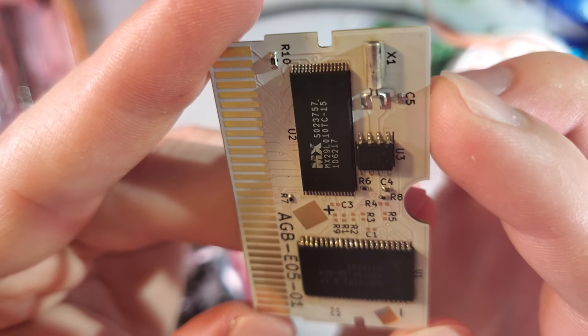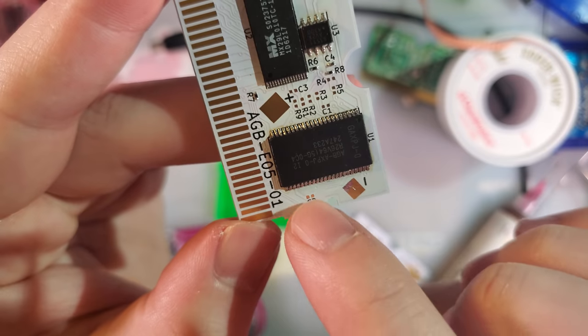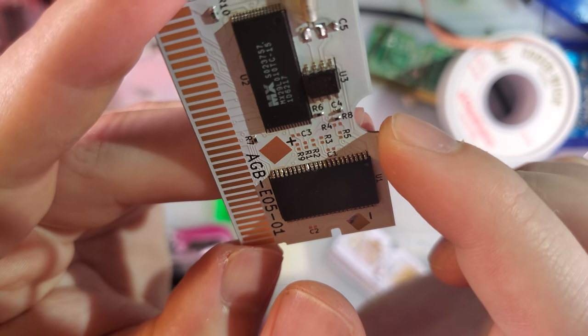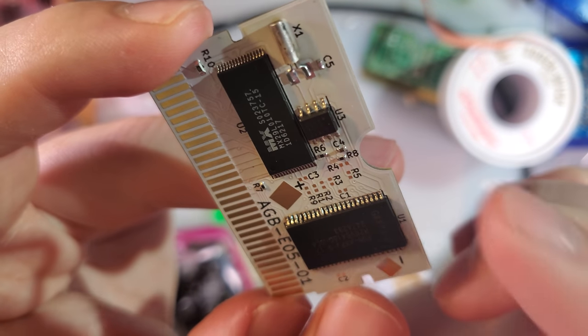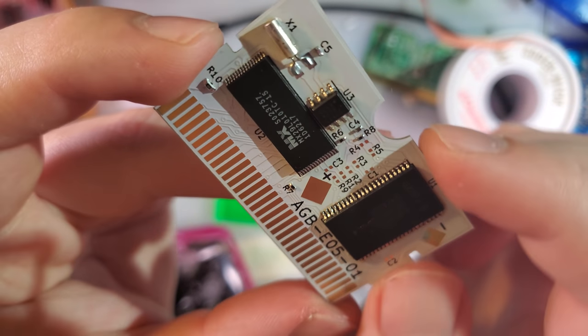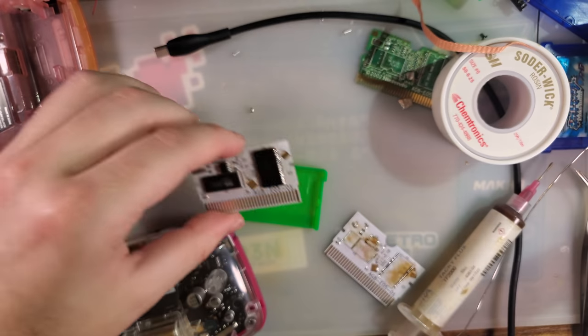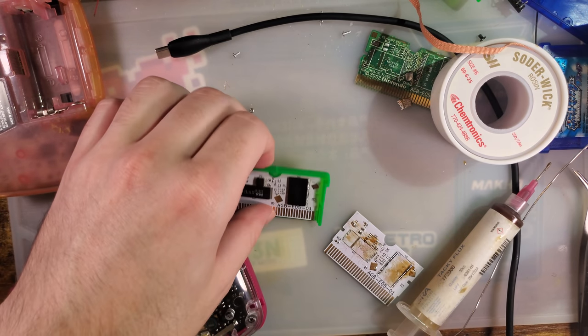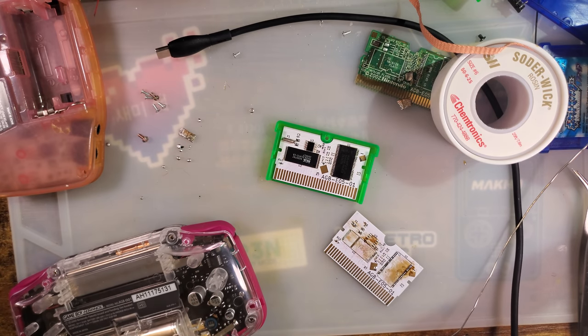All the other components are soldered, at least all the components that I have. I still need to replace C3, C1, C2, R9, and possibly R5. And possibly R4. I don't know about the rest of those, though. But anyway, there we go. Thanks for watching. Hope this helps someone out there who might or might not have a damaged cart that they or someone else tried to replace the battery on and ultimately failed.